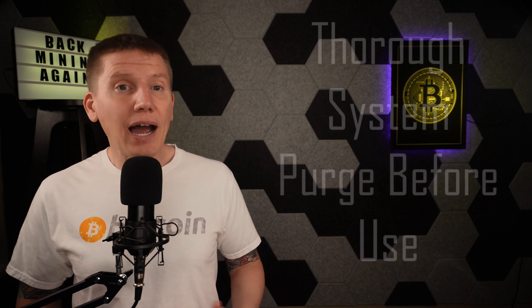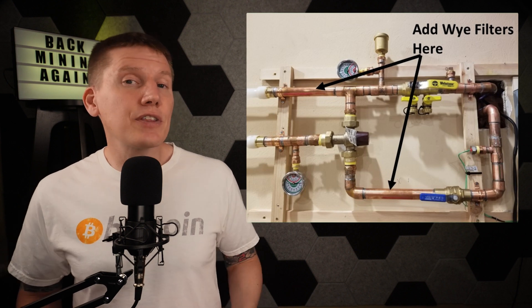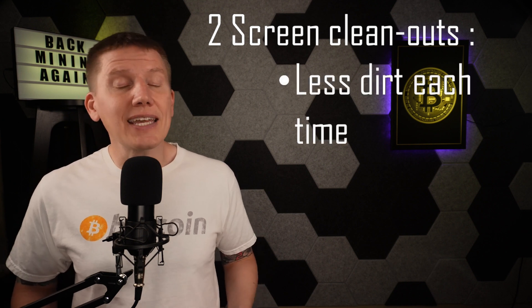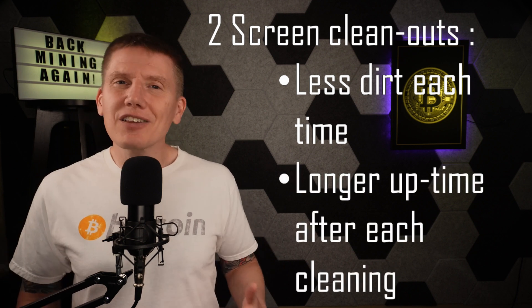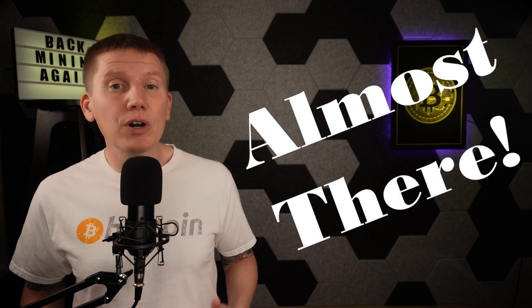With this hindsight, if I were to do this all over again, I would have either done a really good job purging the system, or included additional Y-filters before each side of the mixing valve — those filters would have caught most of the dirt and debris and left everything flowing well. With my system operating over the last month or so, I've had to clean out the mixing valve screens twice so far, and after each clean-out I'm seeing less and less debris caught in the gasket screens. After each clean-out, the system runs much longer before it overheats, and I think I likely have one or two more clean-outs before all the dirt and debris are out of my lines, at which point I'll be able to continuously run my miners at full power without overheating.